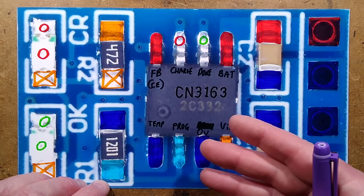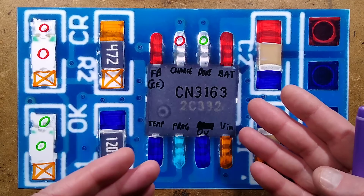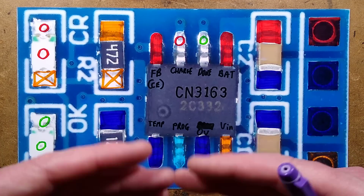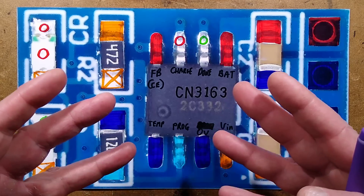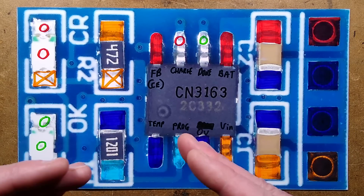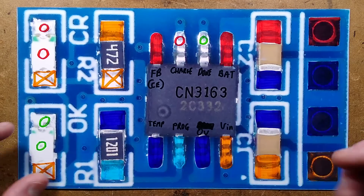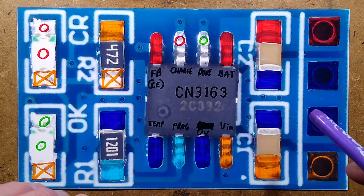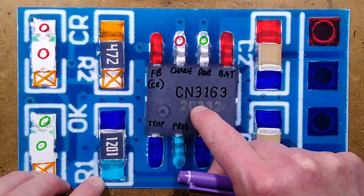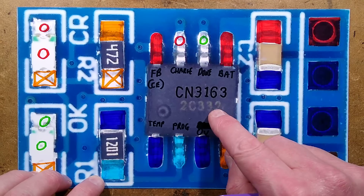It was sold as having MPPT - Maximum Power Point Tracking - which is normally found in bigger solar systems. It adjusts to the temperature and intensity of sunshine, finding a sweet spot for the solar panel to get maximum power out of it - the voltage to current ratio to charge batteries efficiently. This chip does not have that, but what really matters is that it's optimised for use with solar panels for charging a lithium cell or a parallel bank of lithium cells.